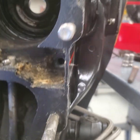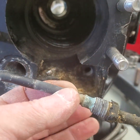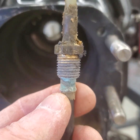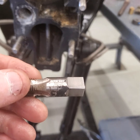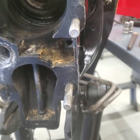There's the end of the cable — that's where I cut it off and I've got the threads there. I'm going to run that tap in there lightly just to clean those threads up. When I put the new cable on, I'm going to put some pipe sealant on the threads because this is going to be underwater. You can use pipe sealant, perfect seal, or a non-hardening sealer. These are tapered threads — just like a tapered pipe thread — and that's why you need a pipe tap. You can't use a regular tap; it has to be a pipe tap. This is a quarter-eighteen tap, and that's the size you need to chase out those threads.